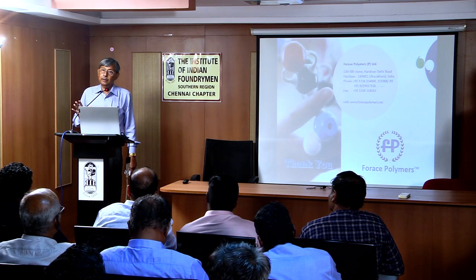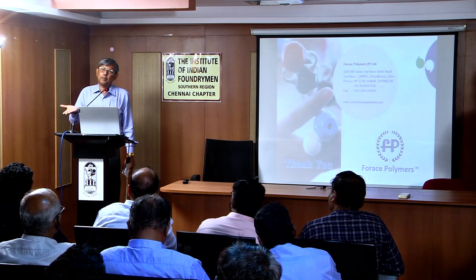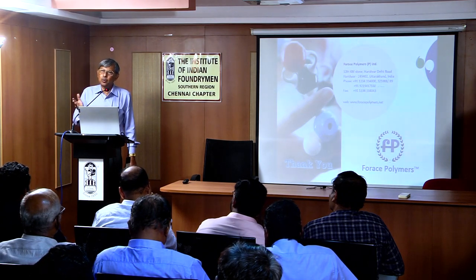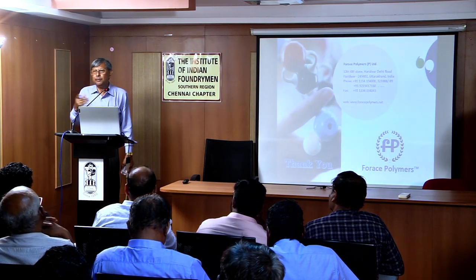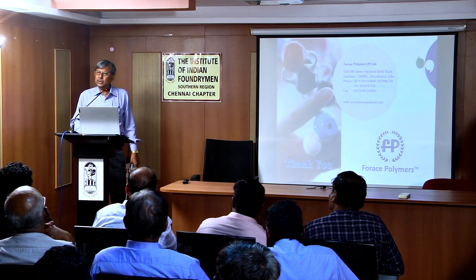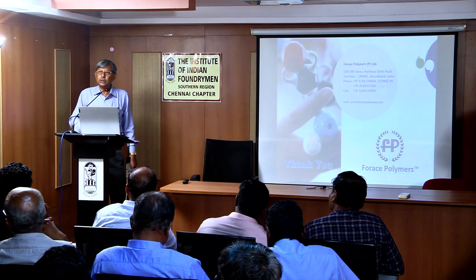So 0.8 is good? 0.8 now is very common. Many of the foundries, very rarely people go above 0.8, for critical cores like water jacket, and when you are using your chromite sand or chromite and silica blend. But otherwise, 0.8 is more or less standardized. We have got sand from Rajasthan sources; you can use that at 0.75 also. Less than that we can proceed. And Saudi sand, there also I think people use it at a very low percentage.